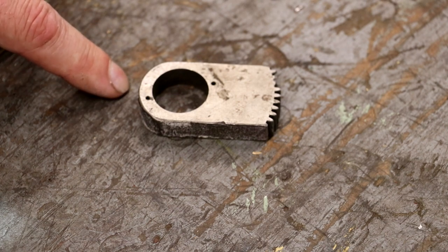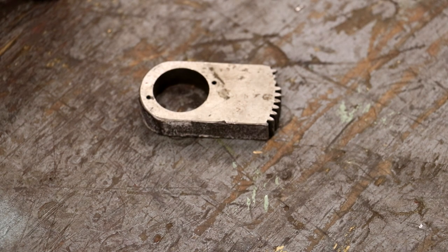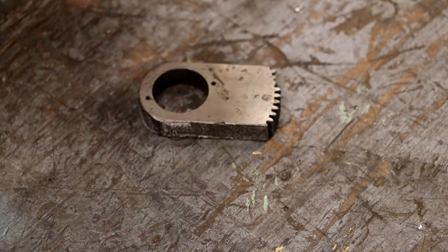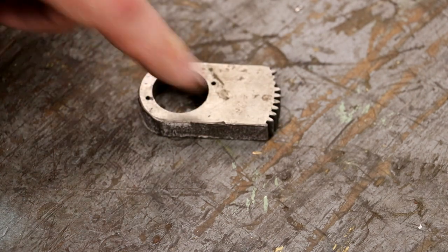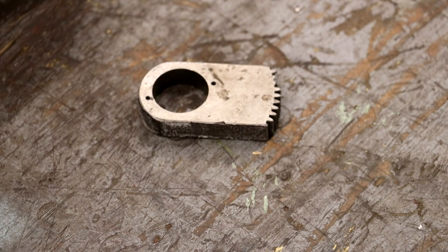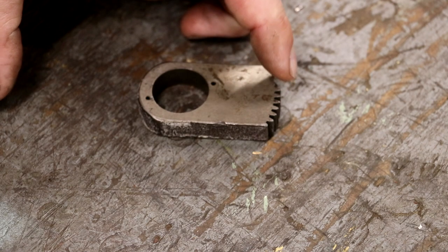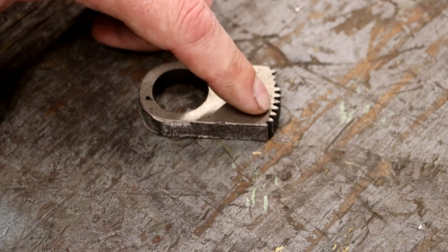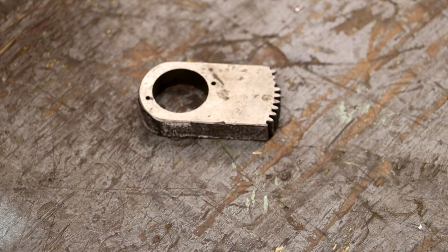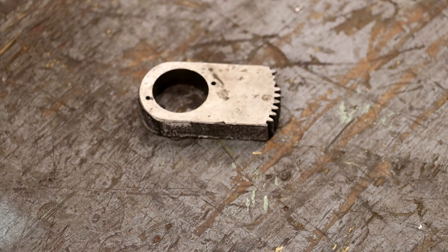This part gave me some challenges figuring things out. When you're cutting gear teeth you need to know how many teeth you have in a full circle, and in this case that's difficult to calculate because I don't have a full circle — I've only got about an inch and a quarter to an inch and a half of teeth to work with. I had to figure out the spacing between those teeth. I know that the diameter changes based on pitch and number of teeth, so I first needed to figure out the pitch, then calculate how many teeth and what the diameter would be.